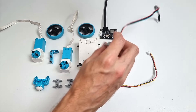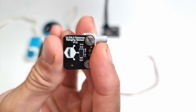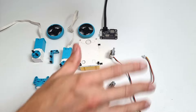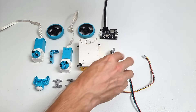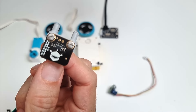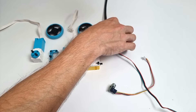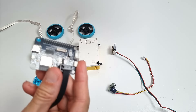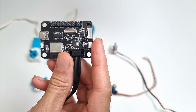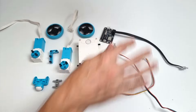This is one brand, and this is another brand of VL53L0X — this is the DF Robot part. They're all the same. Just showing you that you can use different sensors but they have to start with VL53L0X to work on this project. Now that we have our sensors we also need a board. This is the LMS ESP32 board, available on my website, super handy for connecting third-party electronics like these sensors to the SPIKE Prime.